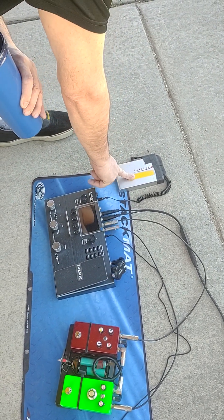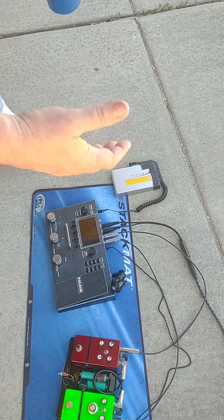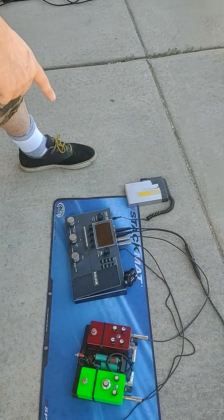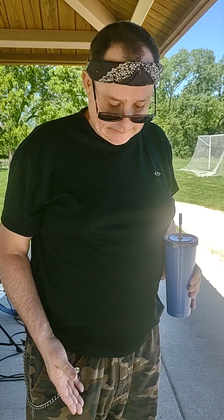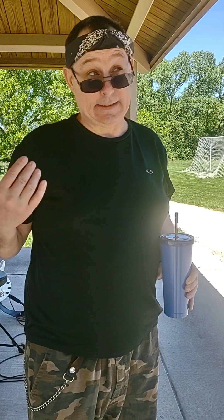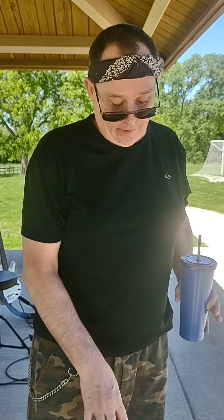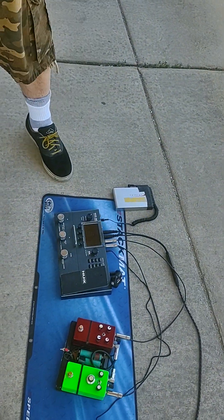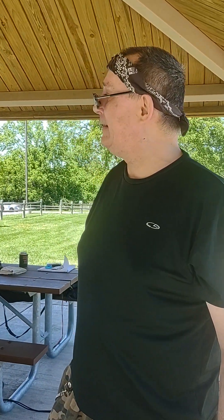This is a wireless. This is a battery pack you'd use for a child's DVD player in the car — it still puts out 9 volts. The XMG30 draws about 400 milliamps, so if we play until it gets darkish, that battery will be dead — it's going to suck that whole huge battery dry. But it's doing a lot; that's really the core of the sound. I could actually not even use these boosts and just go with what's built into the device, but I started putting boosts in the effects loop, and these boosts I'm building sound better than the ones in the digital model.